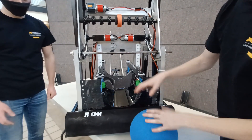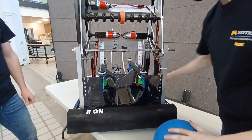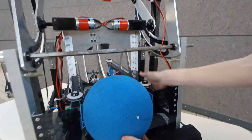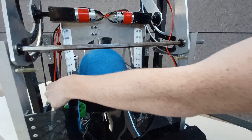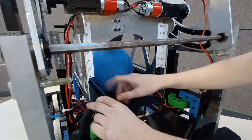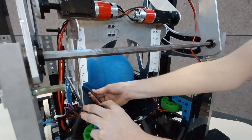The ball storage mechanism starts with this ramp up and tube to keep us above all the electronics and motors. It has these green wheels to help grip the ball and pull it in. And these long tubes are made of pneumatic hosing just welded together.